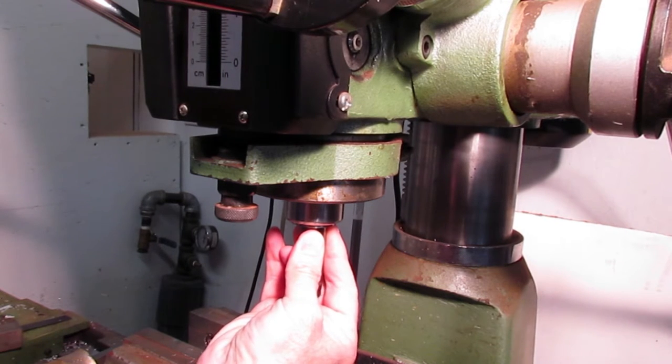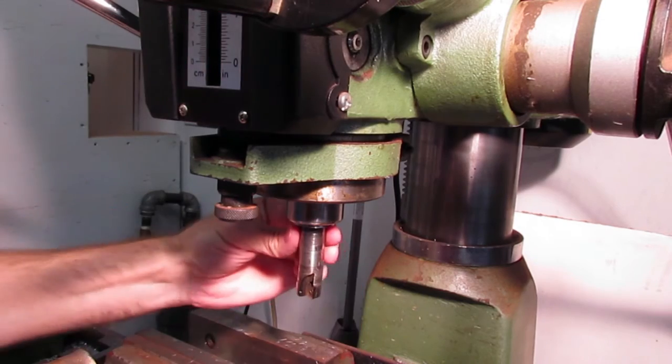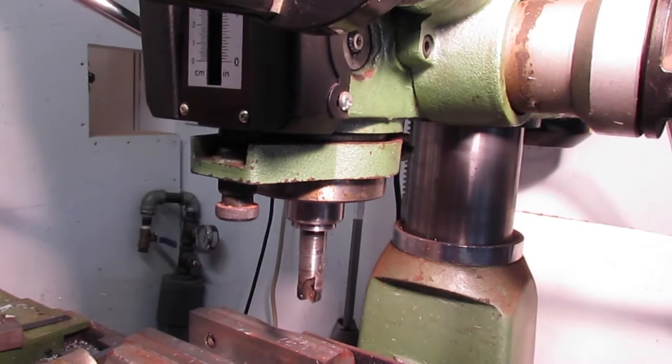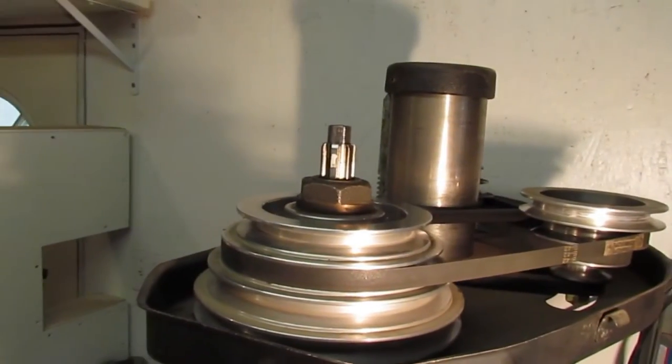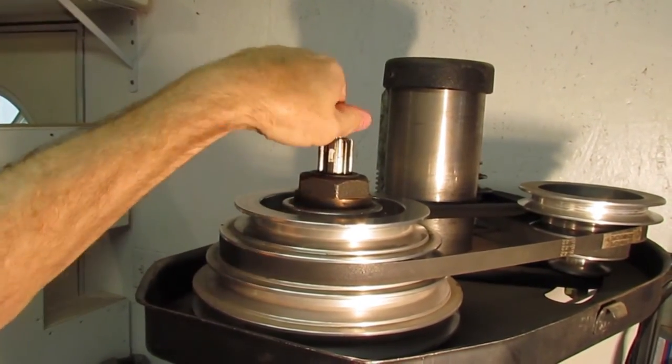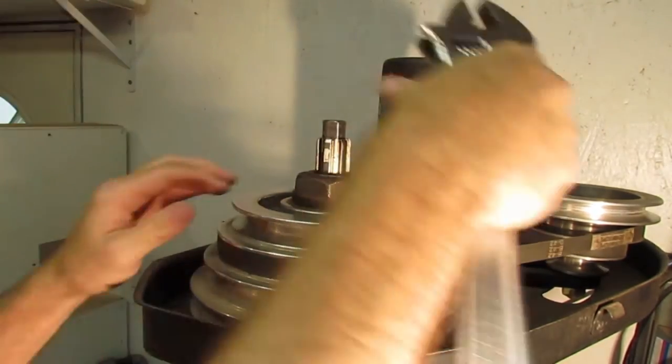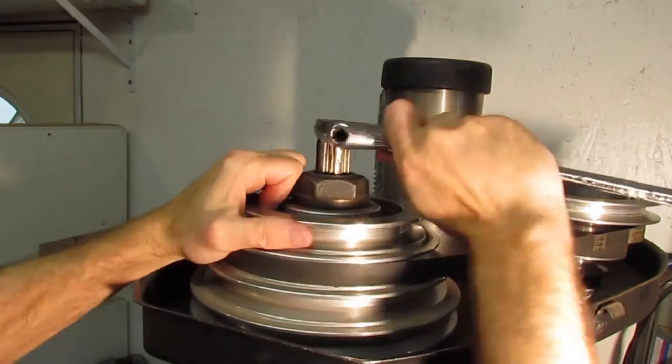We used them a lot back when I worked in a tool and die shop. Worked really well on the CNC mills, and we would feed them upwards of 40 to 60 inches per minute. The mill I'm using is referred to as a mill drill. It uses R8 collets and tool holders. Each one has to be inserted by hand and tightened and loosened accordingly.